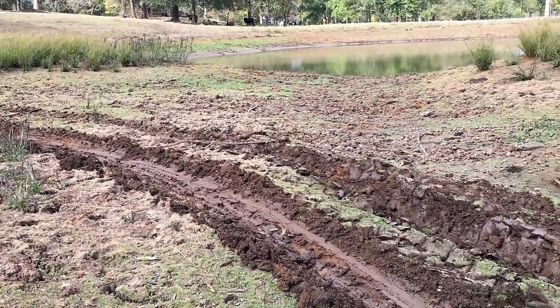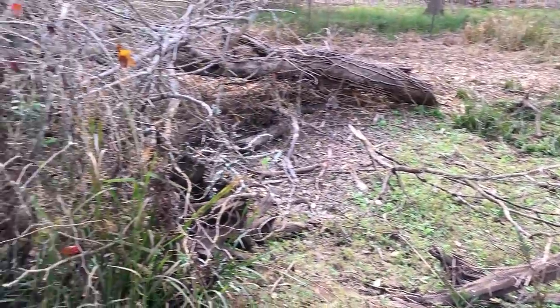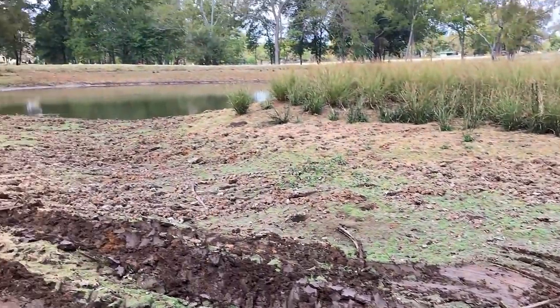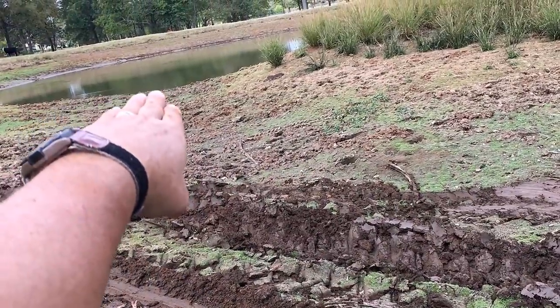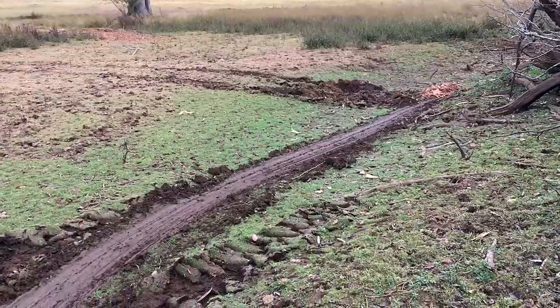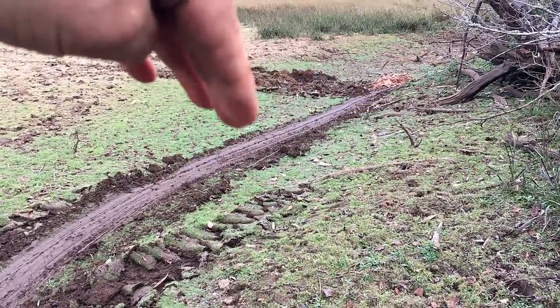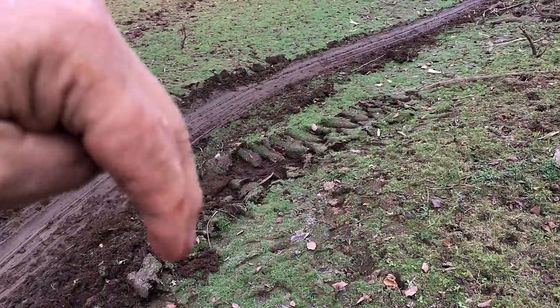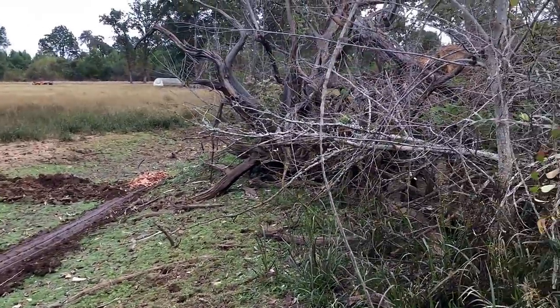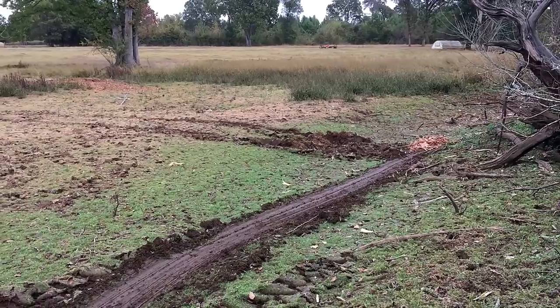That's just a good way to do stuff — if something's in a precarious place, get enough chain or straps together to drag it to where you can reach it by conventional means. This is all where the creek runs into the pond and it stays much wetter than the rest. I almost got the big Kubota stuck right there — it wouldn't back up, so I let go of the log. What you have to do when you need to go backwards: put your bucket down in the ground, then as you drive back tilt the bucket back, back, back and get yourself out of there. That's what I did and it worked. That's how to move hard-to-get-to stuff — we're not stuck anymore, but we are gone.